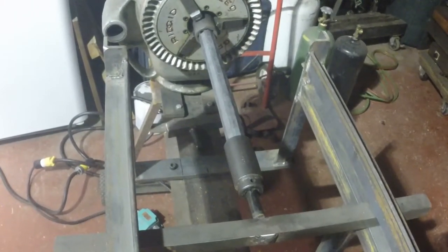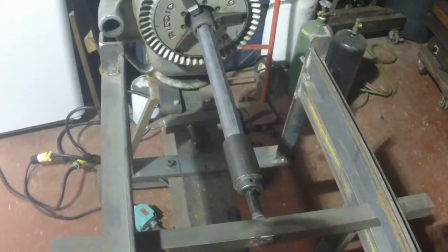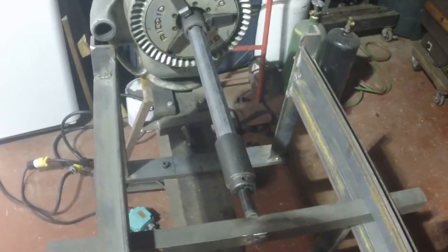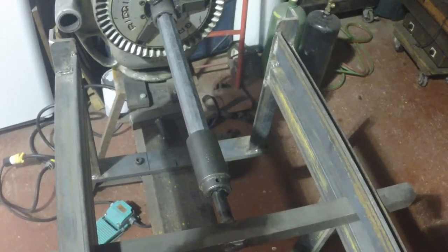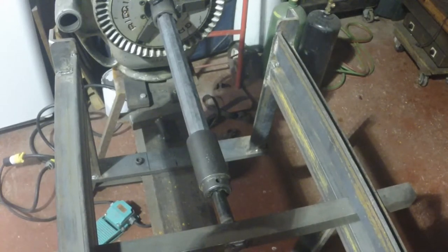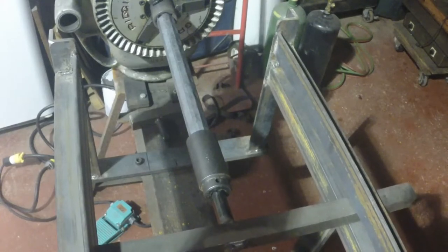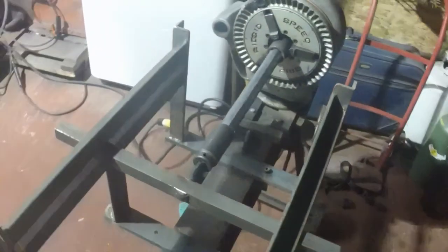Okay, well, here we are. And this is the 324 billet that I just welded up. And it's basically forged into about an inch and an eighth round, or actually octagon. It's got eight sides to it, and those points will come into play in the twist to give it a little character. I'm showing it in the light right now because I'm going to swing the camera over and it's going to get kind of dark, so just bear with me.